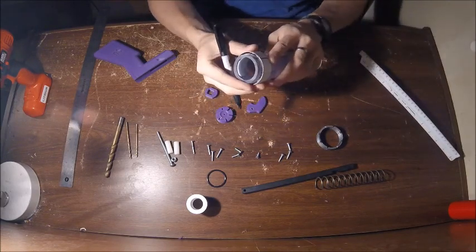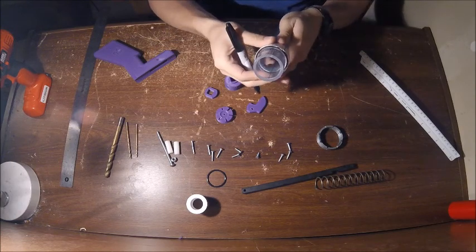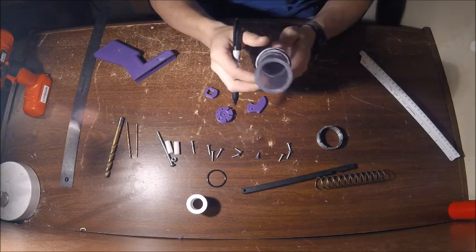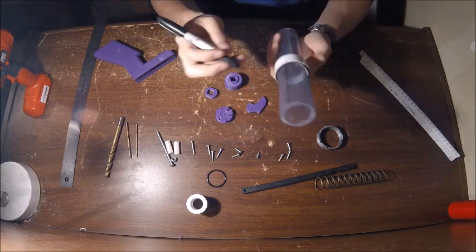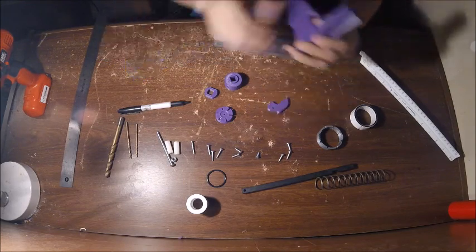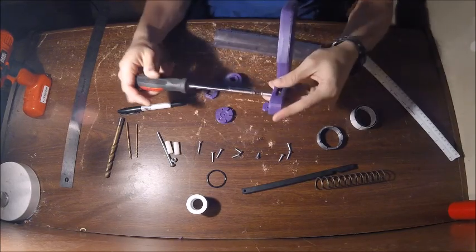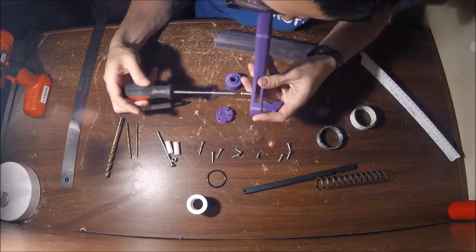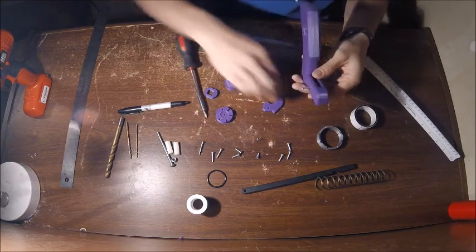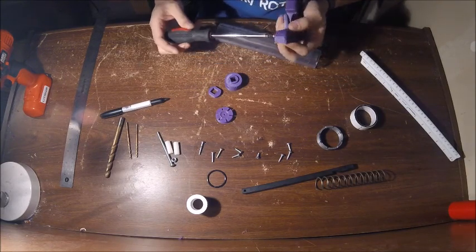With the lines moved to the top, we can get the holes for our screwdriver to be able to attach the handle from the top, which seems to be the quickest and easiest way to do it. So there are three holes on top and three holes on bottom. Then we're going to take our trigger and make sure it fits — put these screws in. If it's still tight, you might want to drill it out, put the screw in most of the way so it comes out one side just a little bit, then put the trigger on that so it sits on the screw, then tighten it down and screw it the rest of the way so it comes out the other side of the handle.